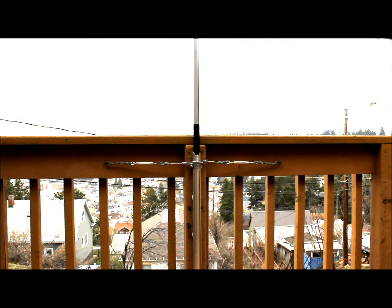Fortunately, I don't think we're expecting thunderstorms tonight that are heavy enough to justify removing this, although I always disconnect my antenna from the radio when I'm not using the radio. The only real way to protect against lightning — pretty much a guarantee — is to do something like this. And then for good measure, you can ground the coaxial cable that leads to the radio, short circuit the center conductor to the shield, or plug the whole thing into a grounded BNC connector. You really have to take every precaution you possibly can if you really want to protect your radio against lightning. And ideally, you'd have to unplug it from the wall, too.